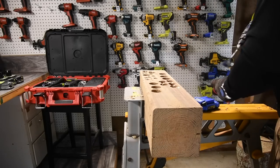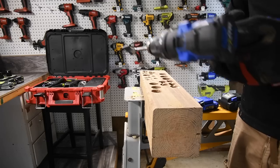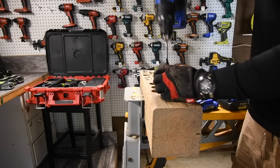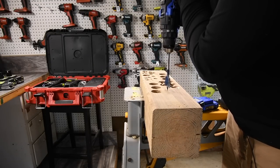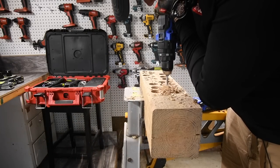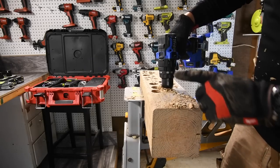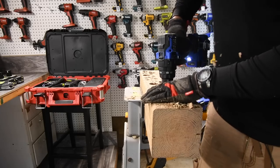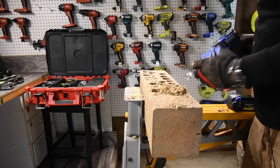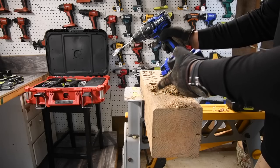All right, really quickly, let's see if the regular 4 amp hour battery could do it. Yeah, I can reach that. All right, here is good. Regular 4 amp hour battery. Ready, go. Time, it did it. So the 4 amp hour and the 4 amp hour ultimate output were successfully drilling that hole, and the 2 amp hour battery did not. It doesn't matter because it didn't even drive it in an inch.